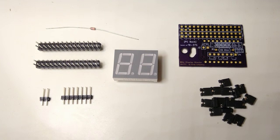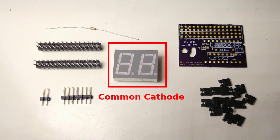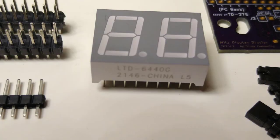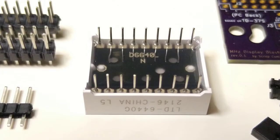To build one you need these components. You need the PCB which is quite small and relatively inexpensive to fabricate. Then you need a two-digit seven-segment common cathode display with a 0.56 inch or smaller character size. These come in various colors but the green ones are not very common. But I managed to get this LTD-6440G which seems to be available new for a very reasonable price.